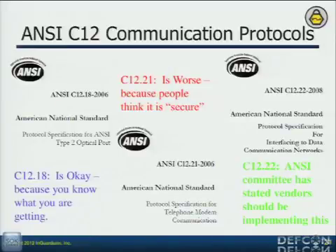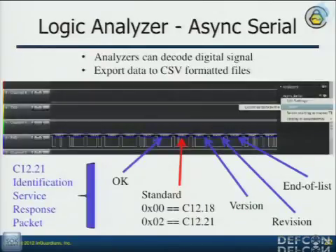Their answer to that was C1222. They worked hard at creating a standard that supported networking and TCP/IP. The problem is they selected an encryption protocol that had not been approved by NIST. NIST didn't approve it because it's vulnerable to attacks — if you send very small packets of one or two bytes, it's vulnerable to brute-forcing the key. In this protocol you'd never send anything less than eight bytes, so it's not actually vulnerable to that attack in practice. But because NIST won't approve it, none of the vendors will implement C1222 until NIST signs off, since they're working on interoperability standards. So ANSI has to go back and fix it — probably around 2015 — then vendors can start development.